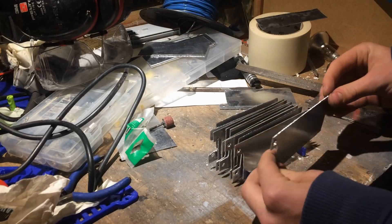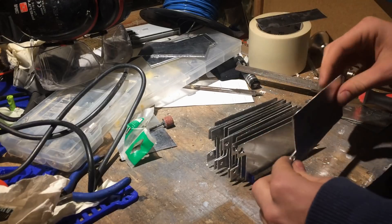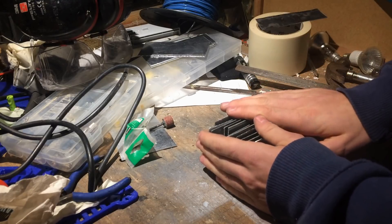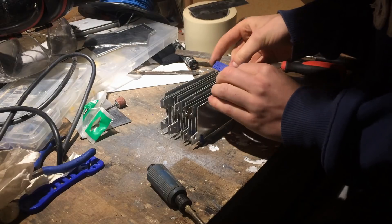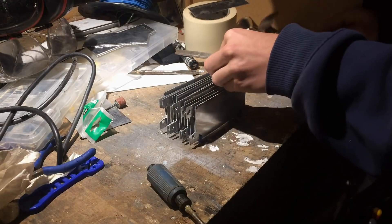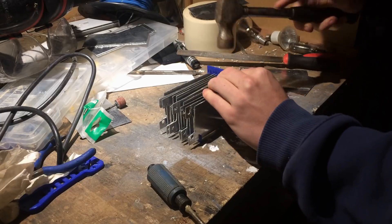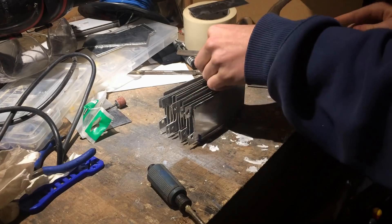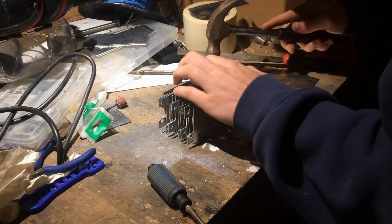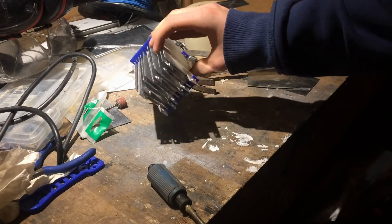There you can see me slotting in the rest of the brackets. The brackets on the opposite side can now be added, and I have to use a hammer to hammer these in because they are quite a tight fit. For the spacings I wasn't really sure what to use, so I decided to use a 3mm spacing between the 2 plates of each cell, and then a 5mm spacing between each of the cells. This looked about right but we'll see when we test it out in the next video.